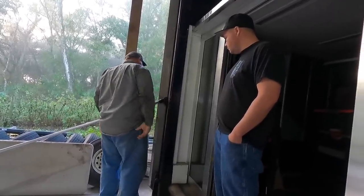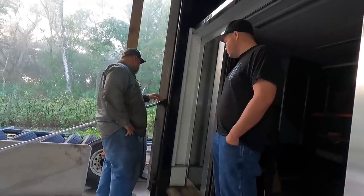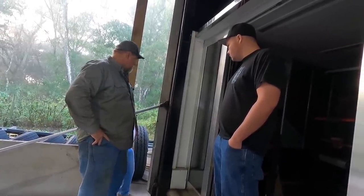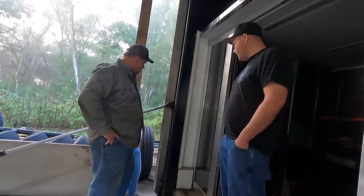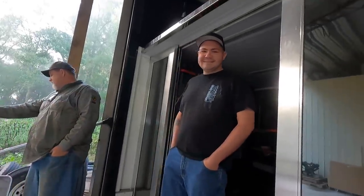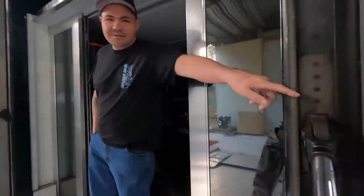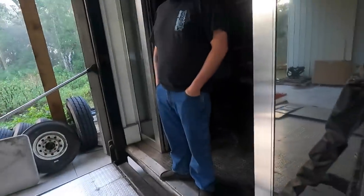But I couldn't get them out of here. I'll put that rosebud torch on and put some heat on that thing, get that thing to expand a little bit. Heat this piece up right here, see if I can get that collar to expand. There's a cylinder inside this casing. She got a leak. Big leak. So we got to fix that today.